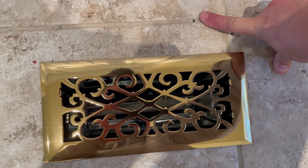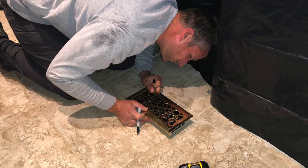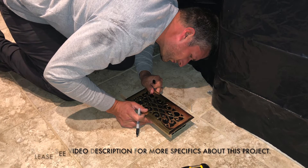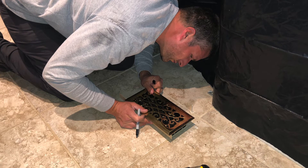And then I adjusted the location of the register about three inches or so. Next I took the register and I put it on the floor and used a paint stick as a bit of a spacer around it to make sure that after my final cut was made, I would have room for both the register and the duct work which would go around it.